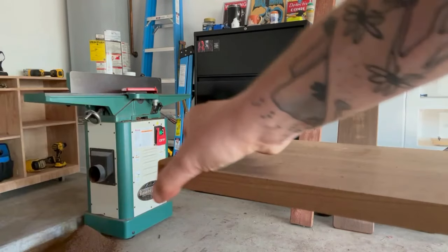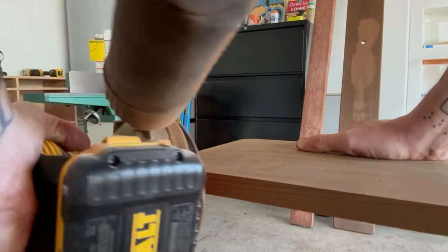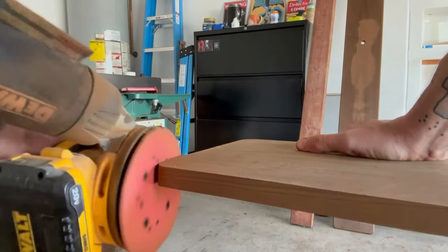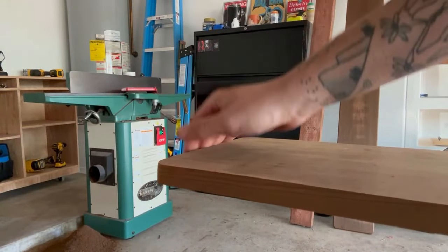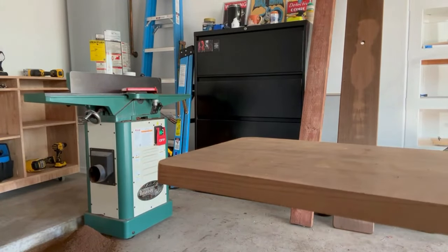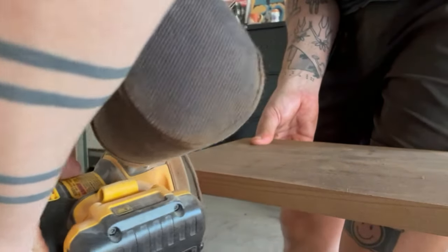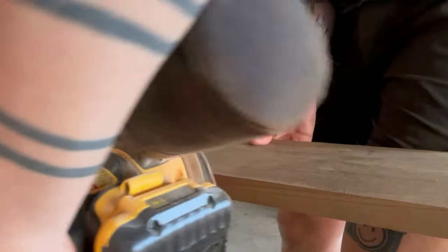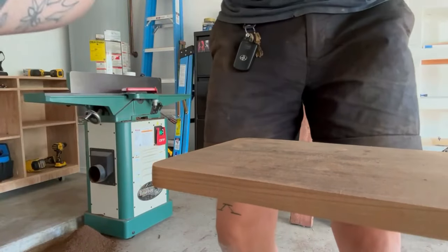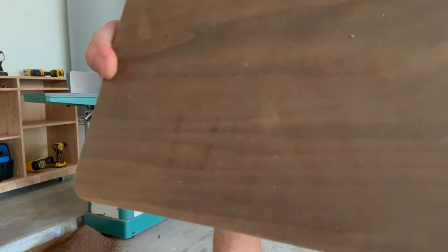Because I'm shaving off quite a bit of material, I went with 80-grit at a higher variable speed, basically rounding that corner in a nice, slow, smooth fashion — not focusing on any particular point, just going across continuously to get it to that template line so I finish with a nicely rounded corner. I do that for all four corners. This really gives it a nice, sleek, and elegant look. Anytime you can round over a board, it just gives it a much nicer looking profile.